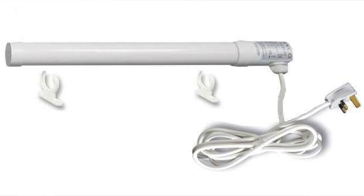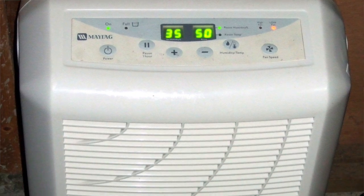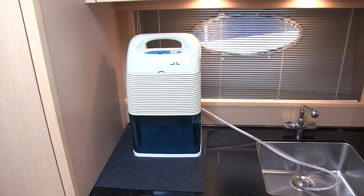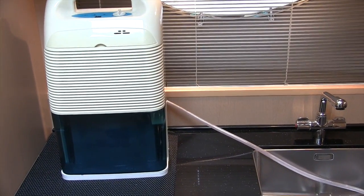The final thing to think about, especially if you are leaving your upholstery on board, is getting a little bit of warmth and dryness into the boat through the winter. A greenhouse heater on low will add a little bit of warmth — that's not a bad idea. But a dehumidifier will work well. There are two types: a compressor type which works well in warm humid conditions but doesn't work well at low temperatures, and the desiccant type which works better when the boat is colder inside. If you are using a dehumidifier you need to consider drainage, because most of them will drain into a little reservoir — if you're visiting the boat regularly that's fine, you can empty that.